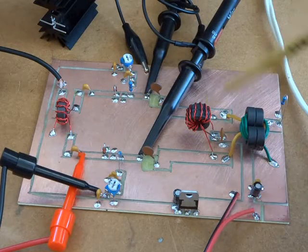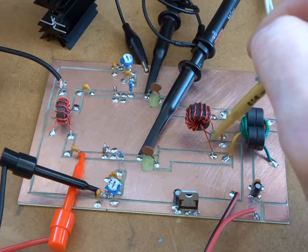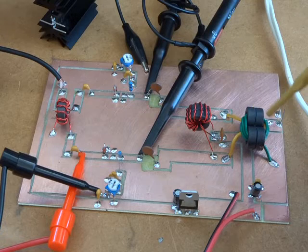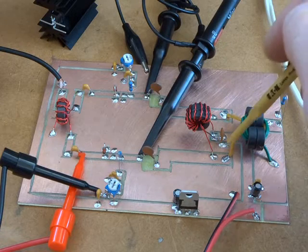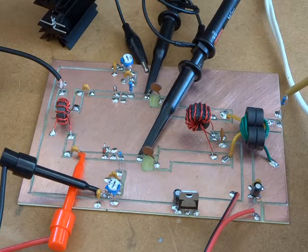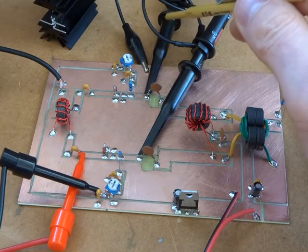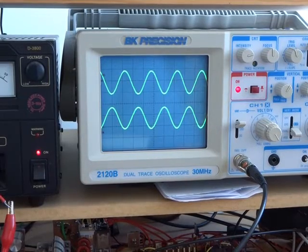Here and here we have the two trim pots providing that variable DC voltage onto the gates to set up the quiescent current through the IRF510s of around 50 milliamps. Down at the bottom is the 7805 — 13.8V on one side down to 5 volts, which runs around the outside per the original design. On the output side, T2 is again two FT50-43s with 10 bifilar turns, set up as RF chokes, providing that 13.8 volts on the high side through to the drains. Our output transformer T3 is made up as a pseudo binocular style toroid — yellow heavy gauge wire, two turns on the primary and five turns on the secondary in green wire. Hanging across for test purposes is a 51 ohm resistor from output to ground. We'll look at the splitting of the signal into two antiphase signals to drive the two IRF510s. The scope is set up on channel one and channel two.